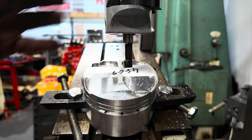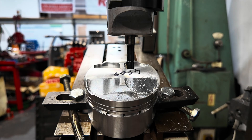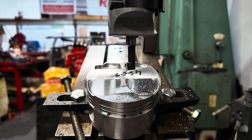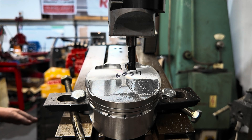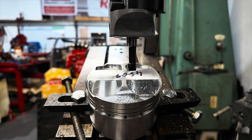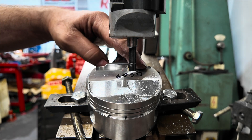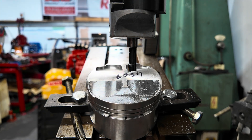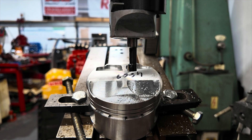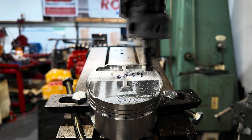I've set up my milling cutter. I'm going in - although I've got to take 1.1mm off, I'm doing it in imperial because I work better in imperial and the machine dials are all imperial. I've set my zeros on the machine so I know that on the slide I've got to come in four turns from when it starts to touch to zero, and I've got to bring this up to zero on the bed as well. Start the machine, give it a tiny bit of spray just to stop the cutter clogging.